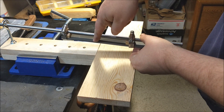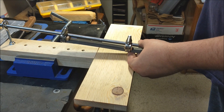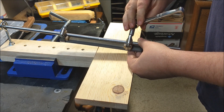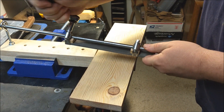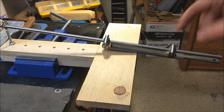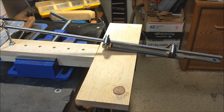The blocks are going to keep the file separate from the guide rod, and the hose clamps are going to go right where the blocks are because that makes the most sense for the attachment point. So that part is built. Now I still have to put all the T-nuts in this part and then glue and screw everything together and it'll be ready to use.